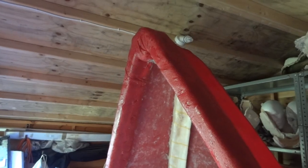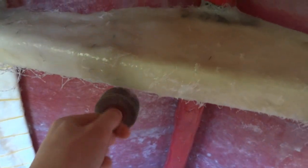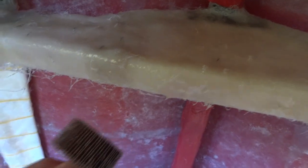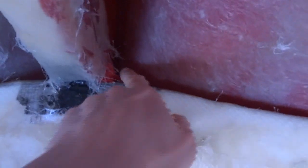It's now several days later. I've reinforced the inside of the boat with fiberglass and it's extremely rigid. It's done 30kg of resin altogether — those are the empty containers — and I've also covered all these bits with fiberglass. There are quite a lot of spiky bits that I need to go and sand off. I've got a flapper disc you put in a drill, so I need to go around and sand all the spiky bits off. There are a couple of areas I missed, but pretty much it's finished.